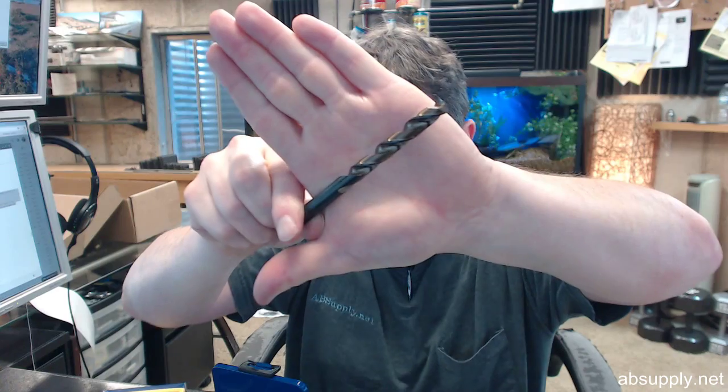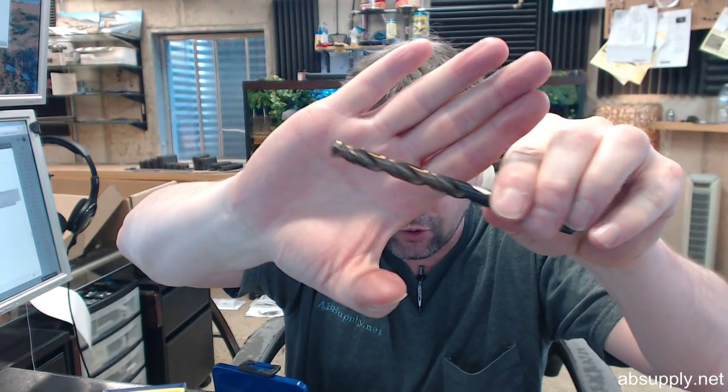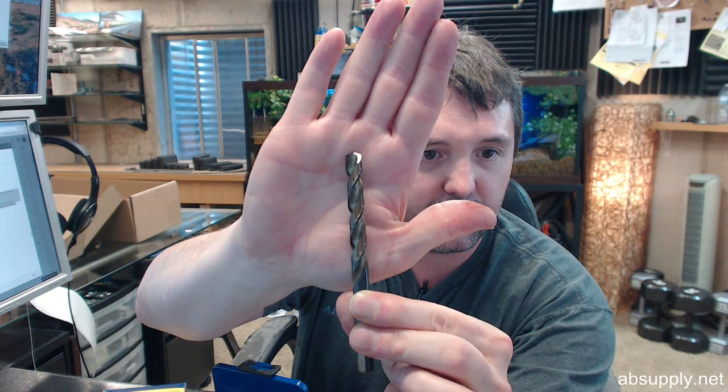So to do a repair, I would very much like to use this Turbo Point tip style. What it allows me to do with that small little Turbo Point — all but impossible to see on the camera — gives me the ability to have my drill bit perfectly centered. That matters because if you are using smaller dowels and you seriously want that screw to insert itself right into an oak dowel, you will want accuracy when you are starting that hole to locate where you are going to insert the dowel.